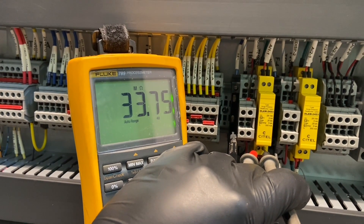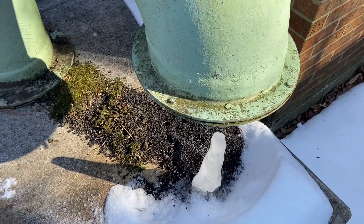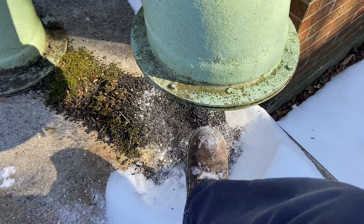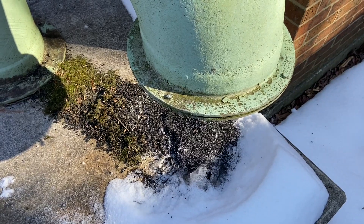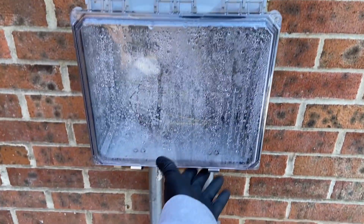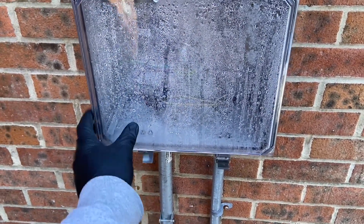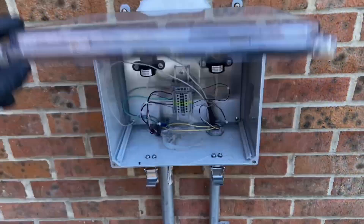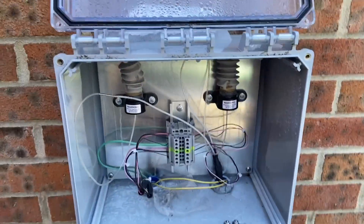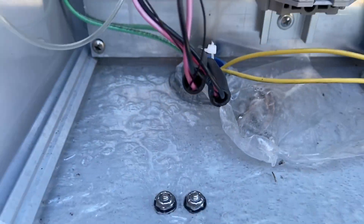Let's go outside and see what's going on. On my way, I found this cool turd sickle — I had to kick it, although it wouldn't have been as fun if it broke my toes. Speaking of turd sickles, this box where the transmitters come in has seen better days. I'm pretty sure the warm air from the wet well is getting into it and condensing, then it got cold and everything froze, so I'm going to have to seal up that pipe at some point. But it did make this cool little skating rink inside. Luckily, it doesn't look like the terminals got too soaked.